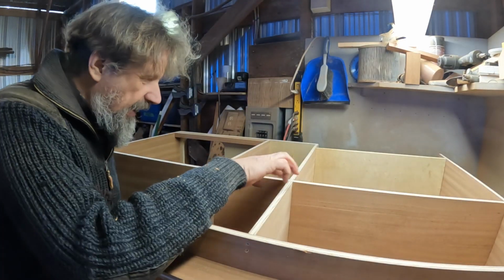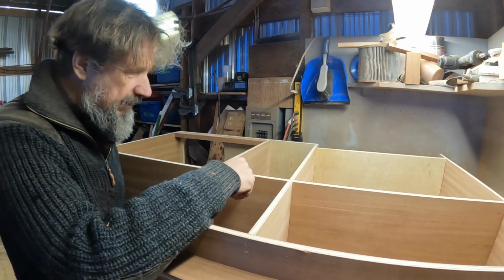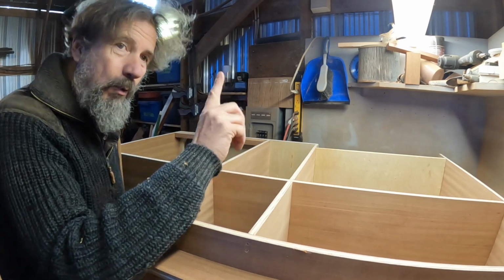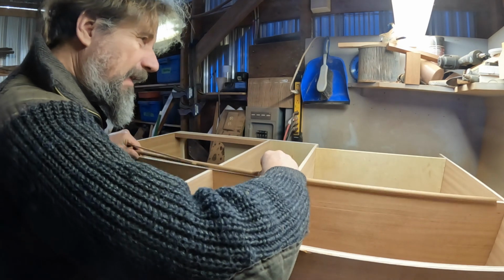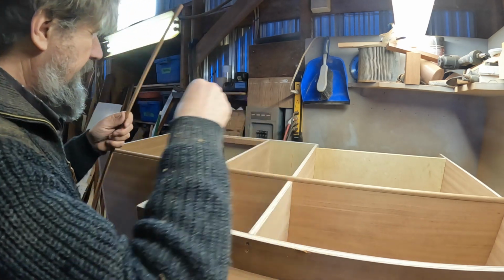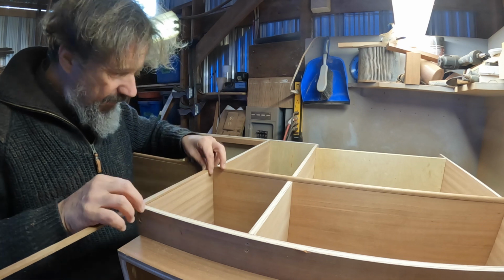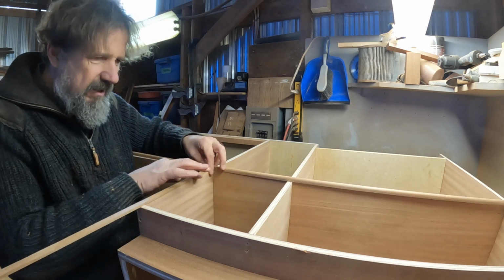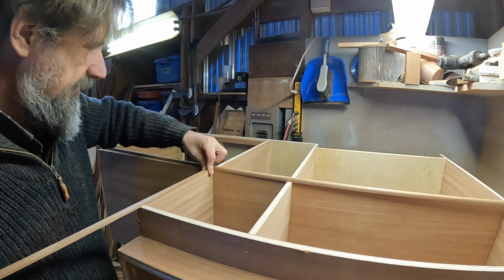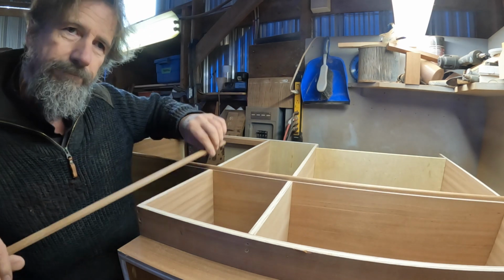Okay, what I'm up to here is tidying up the front edges of this plywood. This is Sapelli plywood with genuine Sapelli veneer on it, but the front edge is plywood. And this is going to be a face frame cabinet. In other words, this is going to be visible. So across this particular line, there's going to be a band that goes all the way around the cabinet. And these other little pieces here are just going to go like that. Be glued and pinned on and sanded clean, eased just a little bit, so by the time I put my beautiful mahogany drawer in here nice and flush, it will be just delightful. Okay, at this point it's just cut, trim, glue, nail.